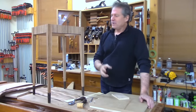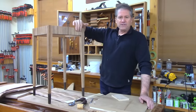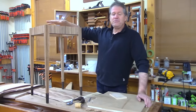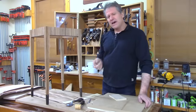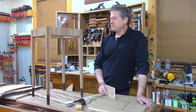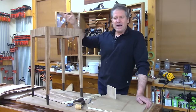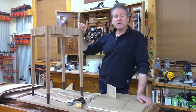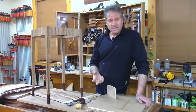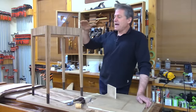Thinking about what would be appropriate on the top — last time we talked about continuing with the zebra wood into the top so there would be continuity, but what would the field be in the middle? I had to decide on the substrate material. Usually on tabletops — like this end table from the Shaker course — the top is three-quarters of an inch thick, but it's undercut beveled so the edge reads about seven-sixteenths thick, looking very thin but appropriate with the thin feet.